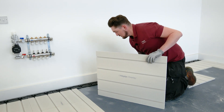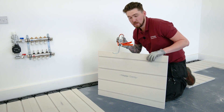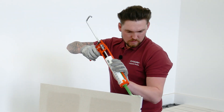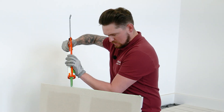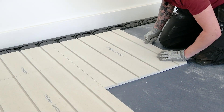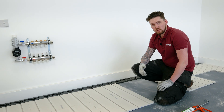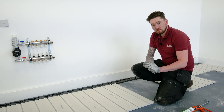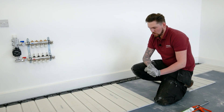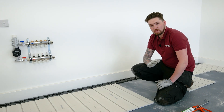Using the Polypipe overlay glue, we run a bead of glue down each edge and then book-joint it up against the other panels. A quick note: wear appropriate PPE when using this glue — we recommend at least a pair of gloves. Also, before you run the glue down the edge of the panel, give it a wipe to make sure it's free from any dust.